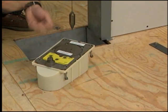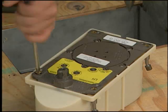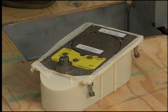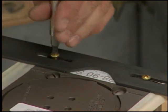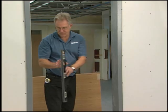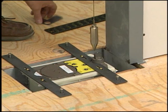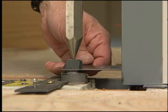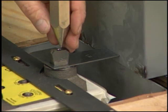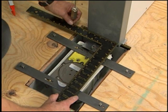Insert the closer into the cement case and secure it tightly with the supplied screws. Masking tape will prevent cement from getting between the closer body and the cement case. Attach the metal straps to the top of the closer with screws, then insert the leveling screws. Make sure the frame is plumb and square again. Lower the closer into the floor suspended by the straps. Place the spindle locator over the spindle and move the closer into position adjacent to the frame — the locator is only used when the pivot point is two and three-quarter inches from the frame. Position the closer so that the center of the spindle is aligned with the plumb bob, and confirm that the cement case is square to the opening.